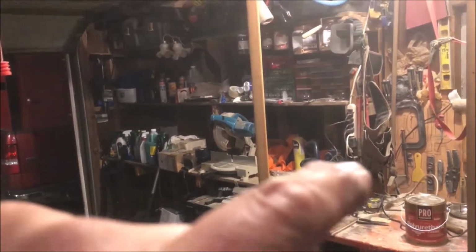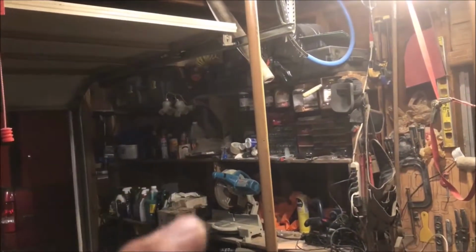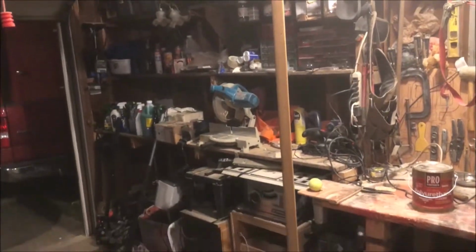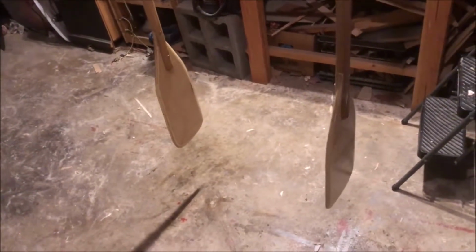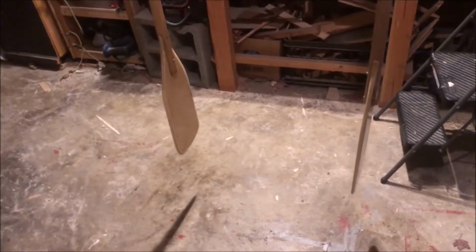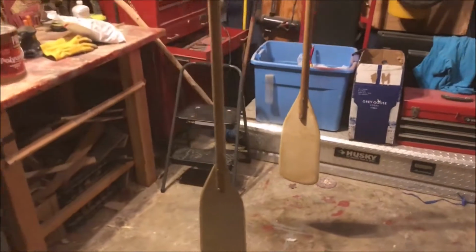Free, my favorite thing. And what I did, I just polyurethaned up here, just the part that's in the water. From there up is just mineral oil, because that's where my hands are going to be. Anybody who's ever used a wooden tool knows that you've got to get that varnish off there, or you're going to have some blisters. So I've got some nice natural wood up on top there with some nice oil, and that'll keep my hands from getting blistered and also preserve it well.